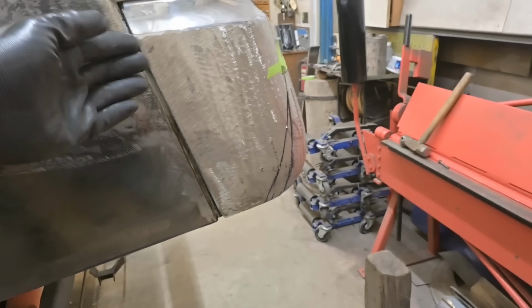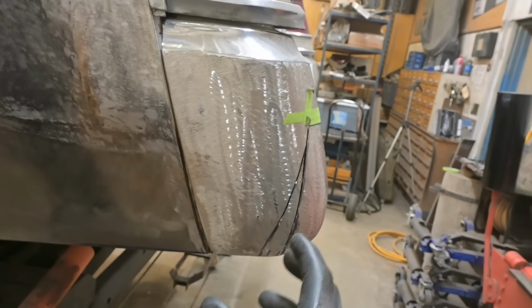And like I mentioned, we only have one bolt and it's torquing. I can do this with, see that? It's torquing the bumper up. So I want to get the bottom bolt in on the bracket, which is down in there. There should be two of them. That's going to adjust that.